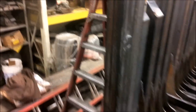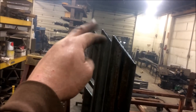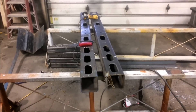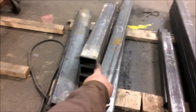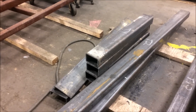Tomorrow I'm gonna do some welding — I got to do the backs of all the stakes, get my ladder up and run down the top back of them. Monday we'll finish the tail assemblies and start building dolly boxes. Adam's getting started laying out some of the flats — there's the dolly legs. I actually use three-eighths wall for my dolly legs; a lot of people use quarter, I think Pitts uses three-sixteenths, but I use three-eighths.